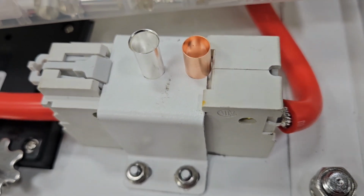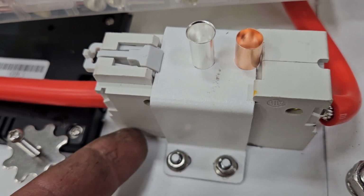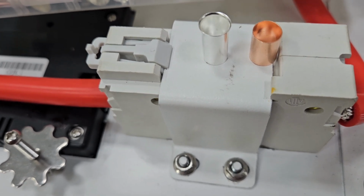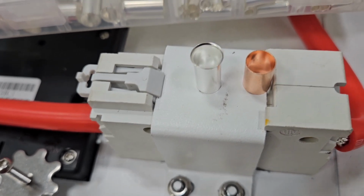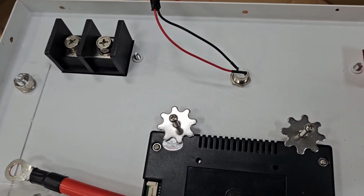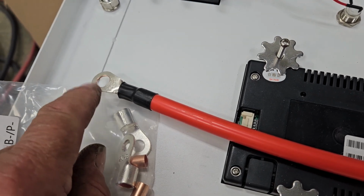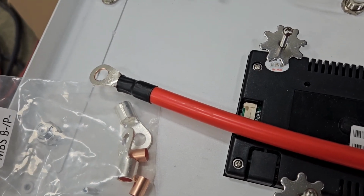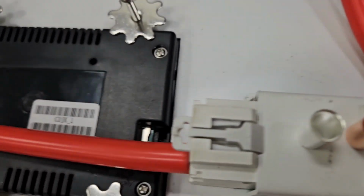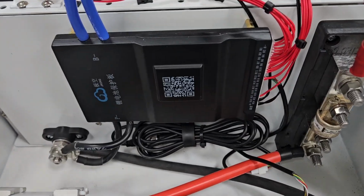One thing I tell you is, don't waste your time putting this bracket on until you got your cables in here, because the screw to tighten it's on that side. You're only going to get to it with the breaker off. So the rest of the front panel I do have together. I got my switch on there, and she's ready to go. I had to bore this one out to fit my bus bar. I had to bore it out to 3/8, just use a step drill. So other than that, this is all ready to go, and we'll get on to the next step.